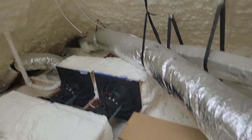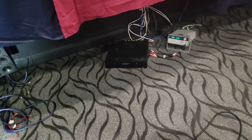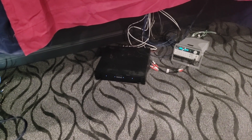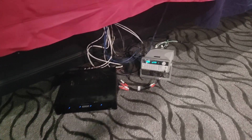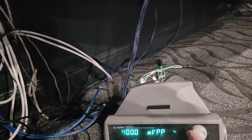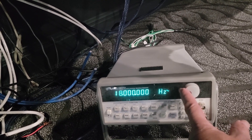If I can manage to get back out of the attic without falling through the ceiling — okay, I'm back out. This is just a little Base-X four-channel amplifier. Each of the four channels is driving two of those woofers up there, so it's maybe 40 or 50 watts per woofer. We're driving it with 100 millivolts on the input — let's bring that up a bit, maybe 500. That's 30 hertz. I mentioned those boards up there; I don't know if you can hear that on the camera, but those boards are rattling pretty good, so I'm going to have to get those out of there.